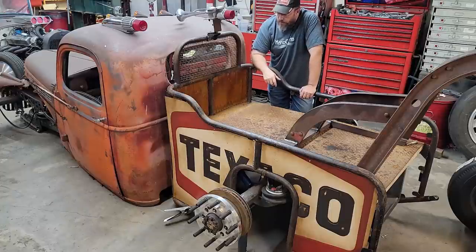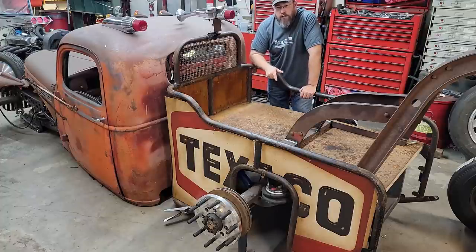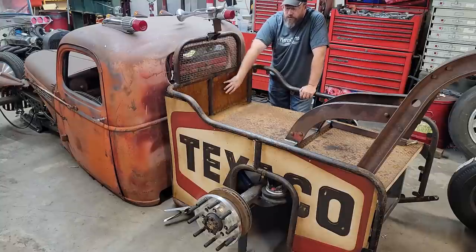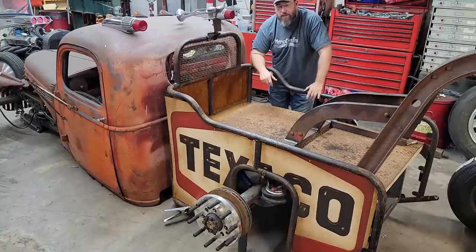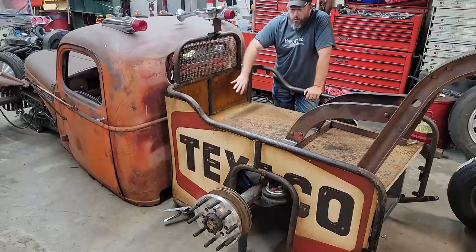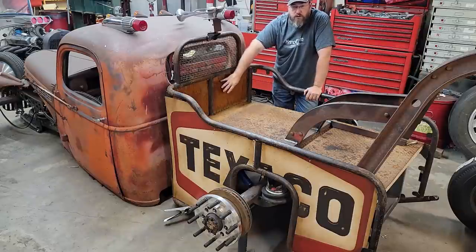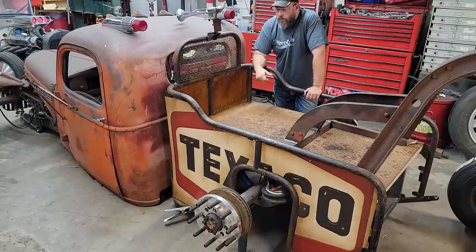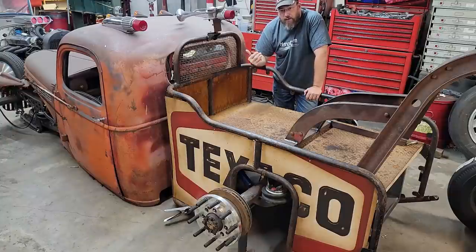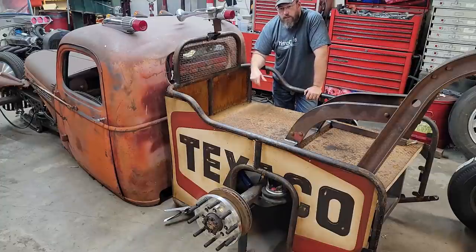And while we're sitting here talking about it, I did go ahead and get some rust on this finally up here. If you guys didn't watch the video where I was having problems getting some rust on there, I'll put you a link to it up above here. You guys can go check it out. But the bottom line, the problem was there was a coating on here that I didn't get off, that they put on from the factory when they make the sheets to keep them from rusting. So I needed to get that off of there, and the best way to do that is muriatic acid. I knew that going in. I've been down that road a bunch of times before, but since we did a little bit of sanding on them to begin with, I thought we might be okay, but we weren't.